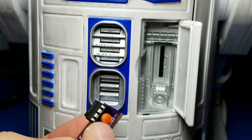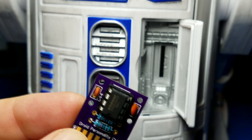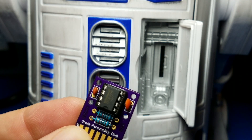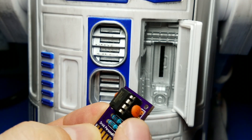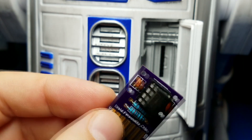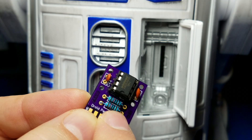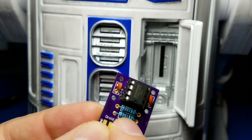You'll need 10k resistors, 10 picofarad and 100 nanofarad ceramic disc capacitors — it's up to you to source those along with the memory chip. You can find the resistors and capacitors easily on eBay or Amazon. Resistors come in packs of a hundred or a thousand, or you might find a resistor kit with several different values. For the ceramic disc capacitors, again you can find kits on eBay and Amazon — just make sure you have a 10 picofarad version and a 100 nanofarad version. And then two 10 kilohm resistors, standard quarter watt — you could get away with eighth watt too, probably, as there's not a lot of power going through them.